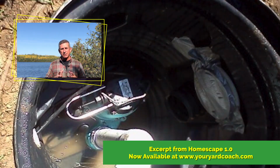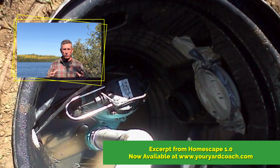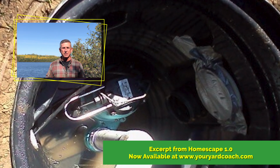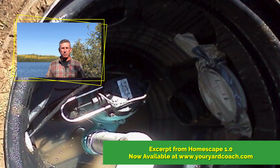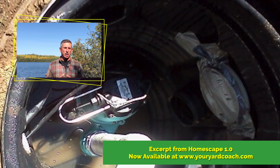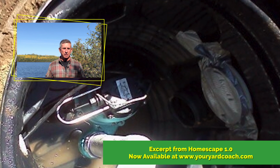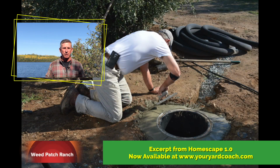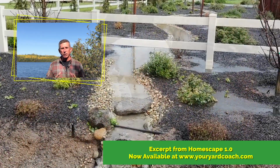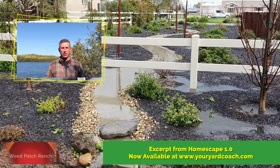You know, in the basin itself, I set up electrical to code right next to the basin, and then I put in a 1 horsepower Little Giant pump, and then I had a 2-inch PVC discharge line that ran about 145 feet down towards the county road. And there it discharged into a dry creek bed and basically drained its way out to the county culvert. It worked out really well, and I was very proud of the project.